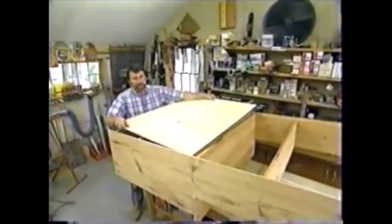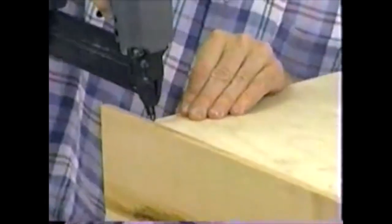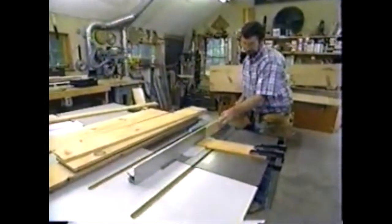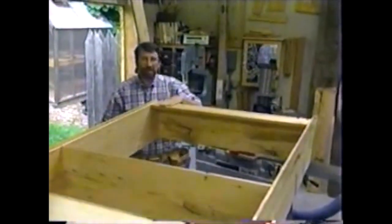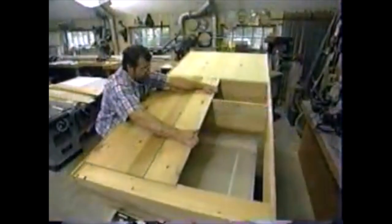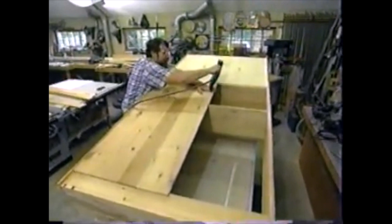To close in the back of the lower cabinet, I'm using a piece of quarter-inch plywood — you're never going to see it. For the back of the upper cabinet, I've been using pine boards since they will be seen. To join the pieces edge to edge, I'm using a tongue and groove joint, the same procedure I used on the dust frames. I also want to put a cleat at the top of the cabinet — the cabinet is narrow and I'm afraid when it's loaded up it might be a bit top heavy. This way we'll have a strong cleat to attach it to the wall. The back pieces slip together and are attached with brads — no glue, because I want them to move.